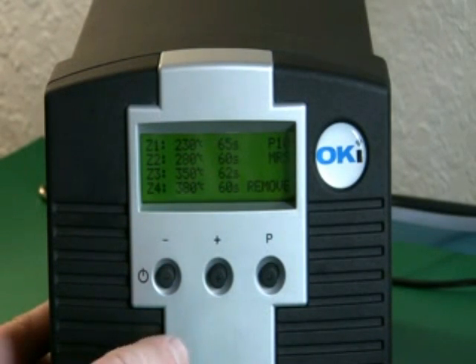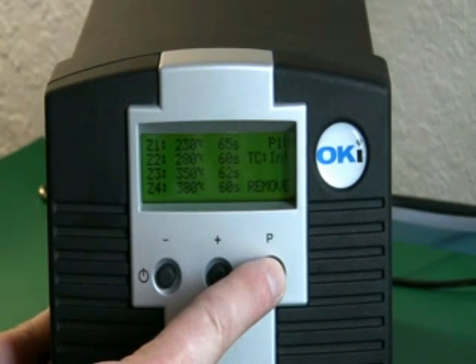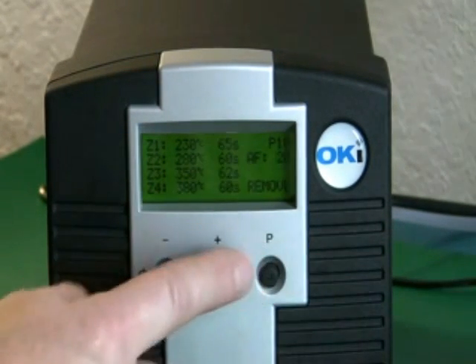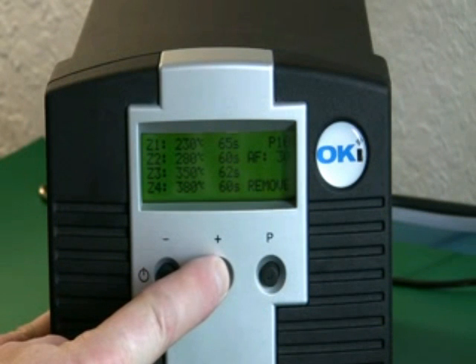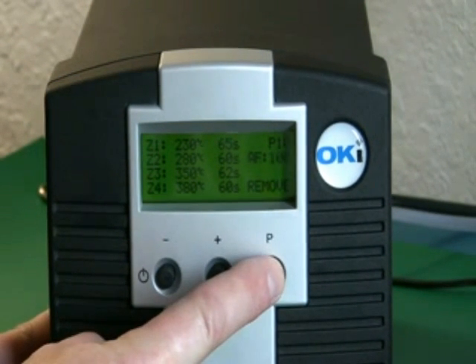You can also see that the MRS button is flashing, which signifies that both the HCT and the PCT are connected together. In this case, we're using internal thermocouples to measure the temperature of the outputs from our heaters, and we can also adjust our airflow. When you adjust your airflow, you will get air coming through your nozzle, and whatever you set it to will become a permanent part of this process.